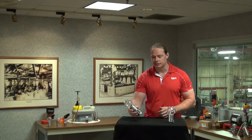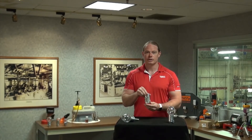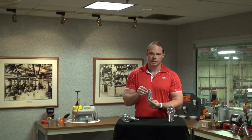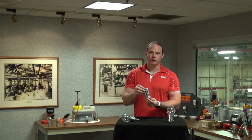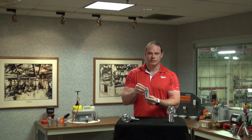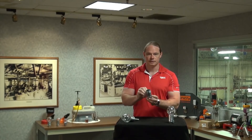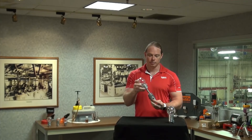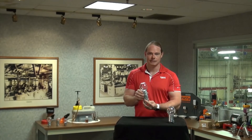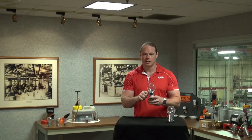To set the closed system, take the upper bottle reservoir apart, and you'll notice on the lower reservoir assembly there is a sliding sleeve. This allows you to set the oil level at the bottom level of this sleeve. Adjust it to the point at which you would like it, tighten the hex or Allen screws on the side, re-apply the upper bottle assembly until the casting sits securely against that lower sleeve, then tighten the knurled thumb knob on the bottom.